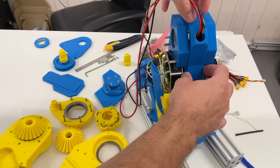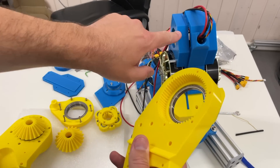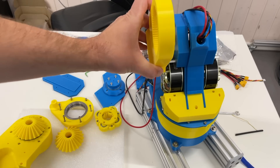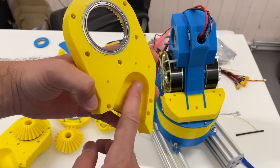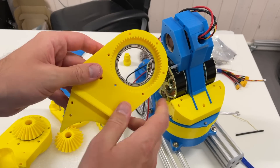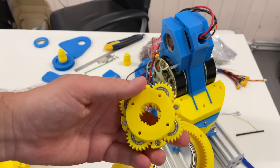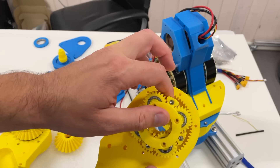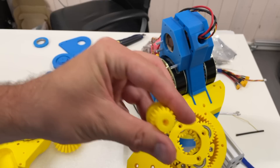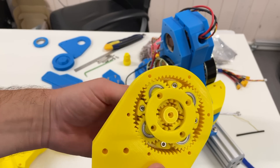All this should go inside, and the cover will cover all of this mess just like this. And afterwards on each side I'm going to install this kind of part. This part has the channel for the air to flow from the fan. Also over here there is a place for the planetary gearbox, and these are the planets — they go inside, just like this. This is the sun, by the way.